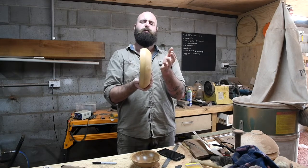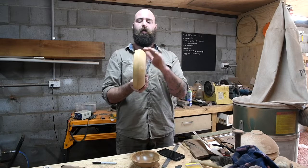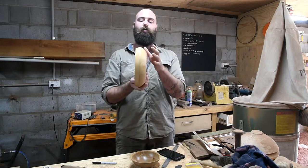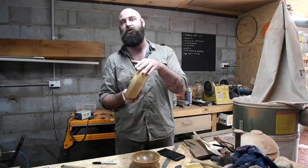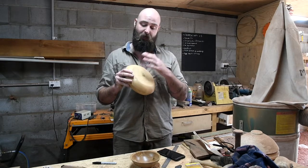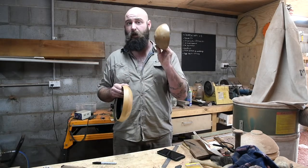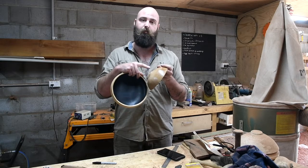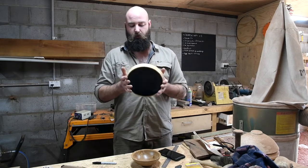In this case it looks like it's about a third of the height. Dealing with that transition and making it not too drastic — there's a sweet spot — and I think I've done a pretty good job. Then comes the sanding and you don't want to round that edge over; you want that crisp detail. I've never done a flat bottom bowl before like this, so again another challenge. This one had challenges around refining technique for the foot, the new shape, and the flat bottom.